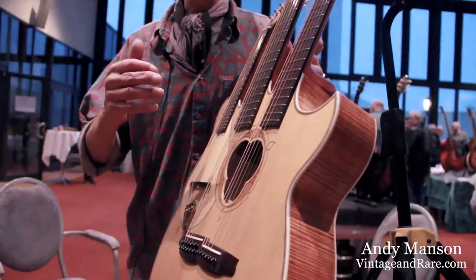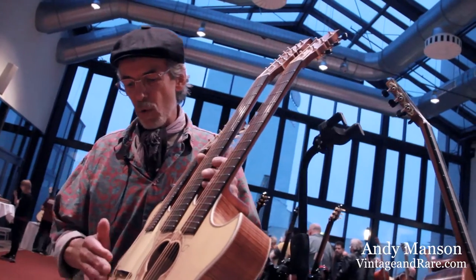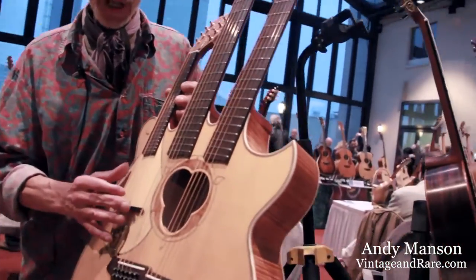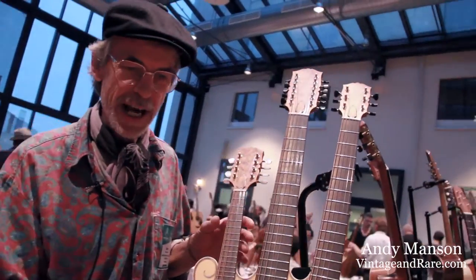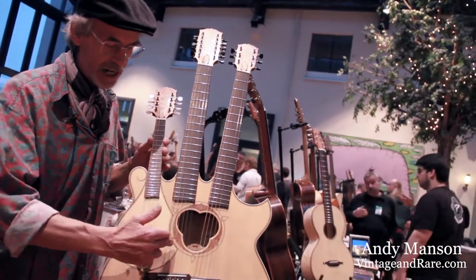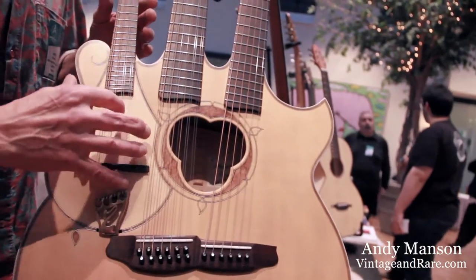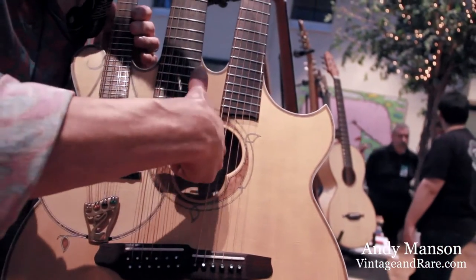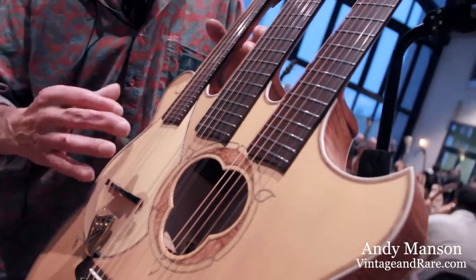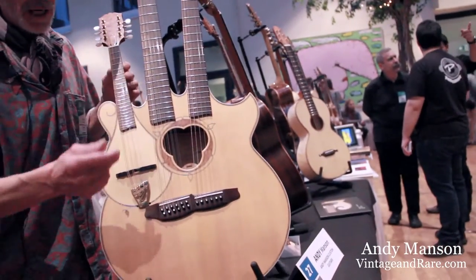This one I wanted to build with a strong acoustic sound, so the whole thing is built much lighter. What happened is this section here, where the mandolin is — because of the lightness of things, this area actually collapsed. So I wanted to salvage it. I cut out the soundboard from this area and built a whole independent section here. It's got sides for the mandolin bit that go through to the back, with a block here which the tailpiece is fixed to. So this is completely independent structurally from the rest of it, and works fine.